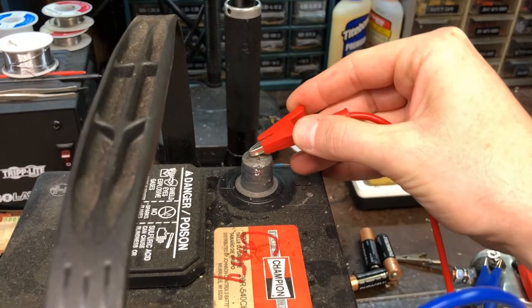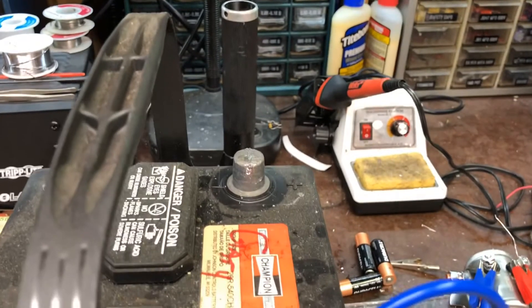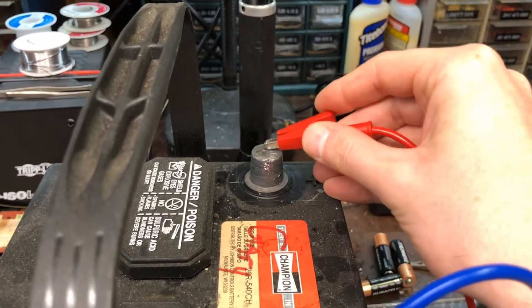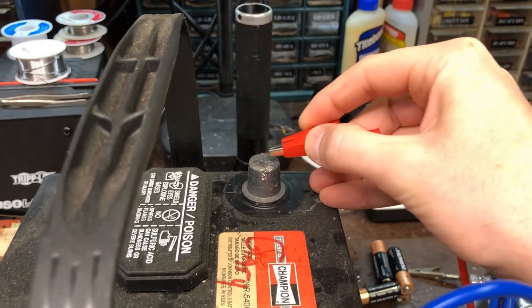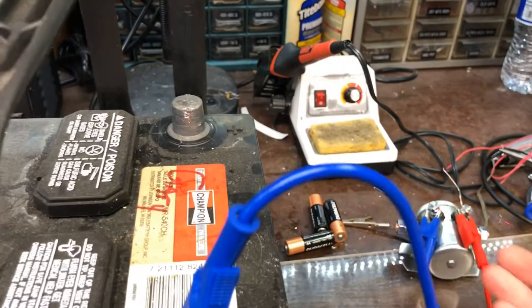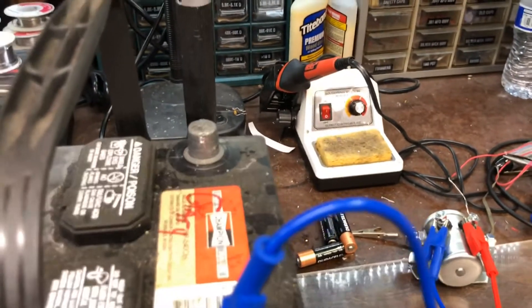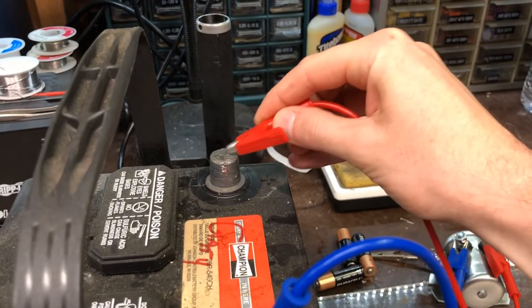That is what will eventually kill a pilot relay, a smaller relay, or a switch of any kind — something that cycles a lot. That arcing burns up the contacts. The phenomenon you're looking at is called flyback. It's the same principle that a coil works on in your car — you charge up your coil, remove the negative side, and you get a big discharge. That's actually flyback.